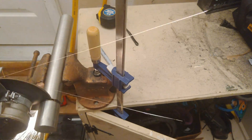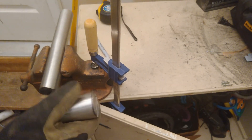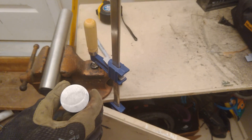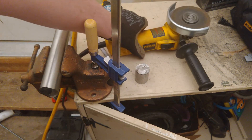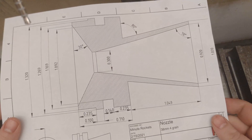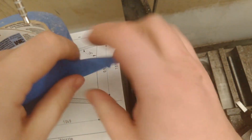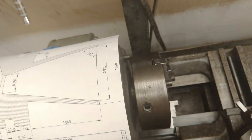Cutting through the last bit in the middle of the bar, we now have our piece of steel — about 2 inches long, 1.5 inch diameter, 303 stainless steel — that will be the stock for our nozzle. As usual, I like to take a copy of the drawing and tape it to the headstock of the lathe so I can refer to it throughout the whole machining process.